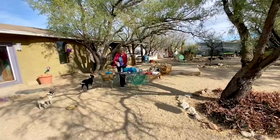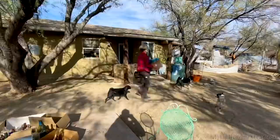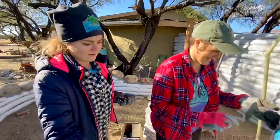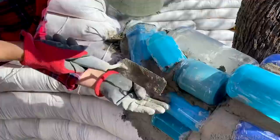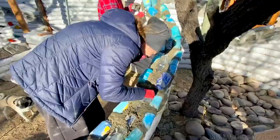When I saved these bottles a while back I didn't save the lids with them, so I'm just going to tape up the top. It's probably not a big deal if stuff got in them, but it has more chance to get light through if we don't have dirt or mortar in there. We're just putting more bottles on it — smurf wall. The hardest part is trying to remember to keep those either up or down. We keep accidentally putting the icky side out. We're mortaring between and putting them in like we would bricks. Every chance we get, we want to put a few more layers of bottles in so they can solidify and we can keep growing that bottle wall up at a nice pace.